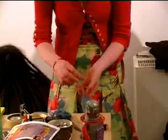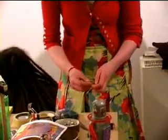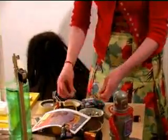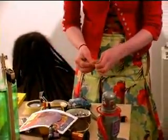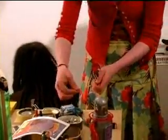About 200 turns, and the coils should be about this size — a couple of centimeters. They should be a little bit bigger than your magnet, basically. And you want to leave a bit of a gap between each coil and a bit at the end of each.